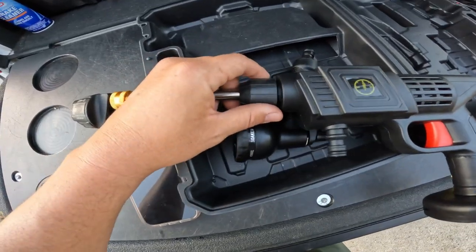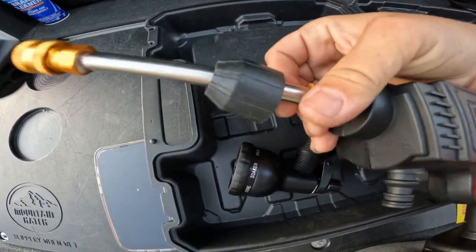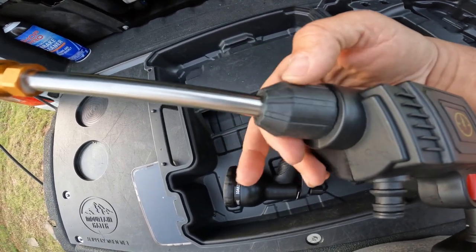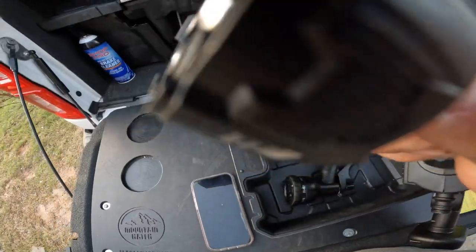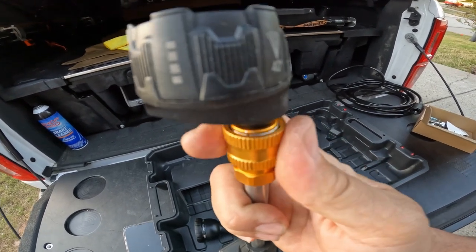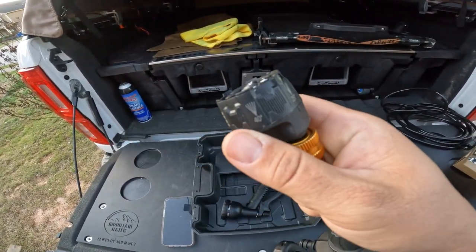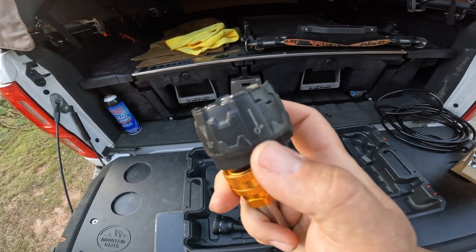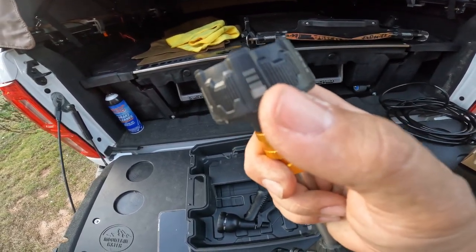Going to the connection point — this is a screw-on type of connection. There is a plastic sleeve that goes over the top; it's kind of loose but I would just keep it there. I don't think this is brass — it looks like an anodized aluminum. It's got your standard type of connection for a pressure washer gun. Now there are multiple settings on this pressure washer tip: you've got your standard pressure washer setting for washing the vehicle, a 15 degree, a zero degree which is basically a straight line, a 25 degree, a 40 degree, and shower modes so you can rinse yourself off.